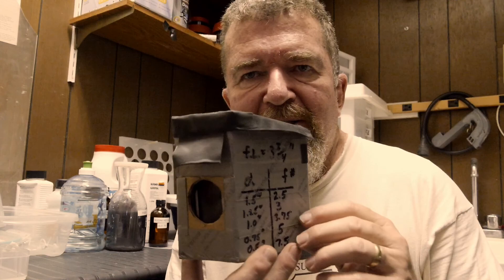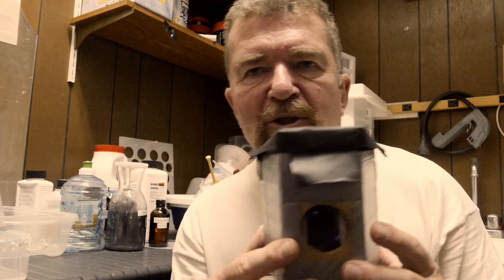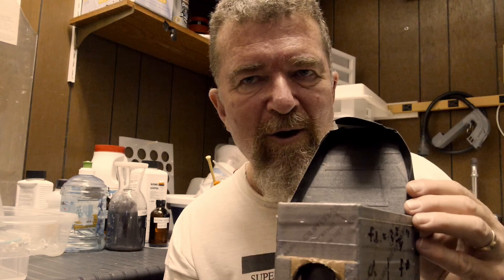When you're a tinkerer or hobbyist, one of the first rules is never throw anything away. Here's a great example — a cardboard and duct tape camera I built maybe 20 years ago with a plastic credit card-sized Fresnel lens magnifying glass on the front. It has a focal length of about 3 and 3/4 inches. My original intention was to put 4-inch square pieces of sun print cyanotype paper in it and expose a scenic landscape. I needed a fairly fast optic, which is why I used the Fresnel lens magnifier, stopped down to a 3/4-inch aperture — about f5.